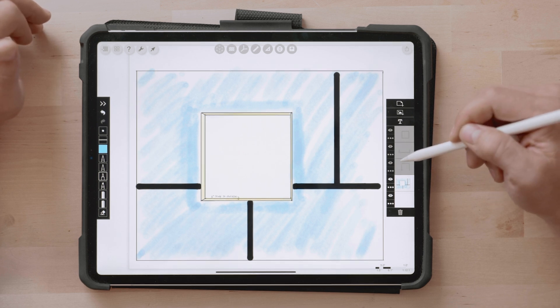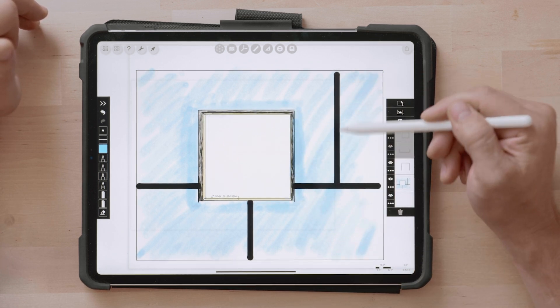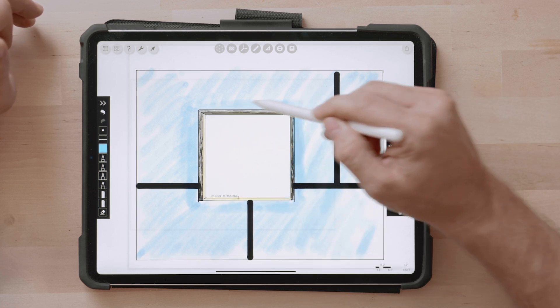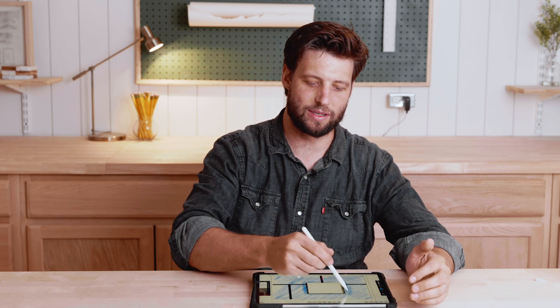You can use spray foam, but even with spray foam you're going to need some gap. Today we're looking mainly at the weatherproofing from the outside, so let's prepare our opening. The first step is to use acrylic tape — the same tape used for the seams — and take that tape up and around the opening, tying the ends of the board back to the framing. When I do the air sealing from the inside, I'll also tie back to that framing, so I want to make sure there's nowhere for air to get in between my sheathing and my framing.